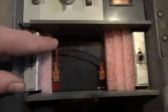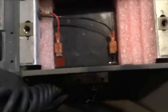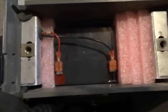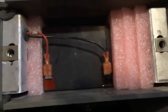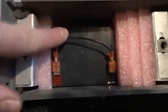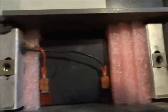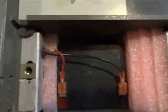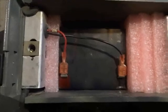This is the battery inside the 4930A. It has a rechargeable 12-volt battery, and this replaces the lantern batteries that were in there before — I believe there were two lantern batteries tied in series to make 12 volts. So we have a rechargeable lead-acid battery in here now, so that you can recharge this when the batteries go dead using a 12-volt source, such as your cigarette lighter in your car.